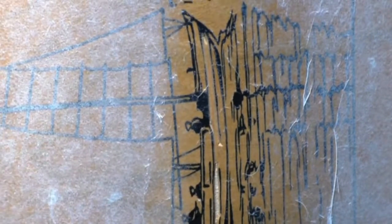So first of all, the blocks are planed. My dad planes the blocks up with a scraper plane. And then the wet sanding process: I start at, I think, 480 grit, and I move all the way up to, I think, 2,500 or 3,000 maybe. Just move through the grades, not every single grade in between.